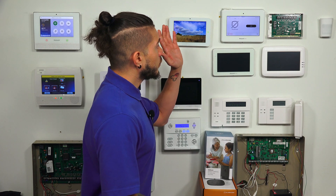Everyone's super excited, and hopefully this video helps you guys remove devices on your own now that we have access to it. The first thing you're going to need, if you do have a Pro A7 Plus security system or the Pro A7 Plus C, is the installer code. Typically, the Honeywell installer code is always going to be 4112. Yours may be different if your company or yourself have changed it. If you're monitored with us, we usually like to leave it as 4112 for troubleshooting purposes, as it's easier for a lot of you DIYers out there to remember it.